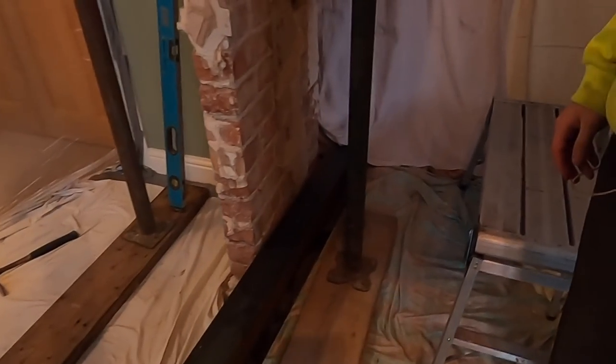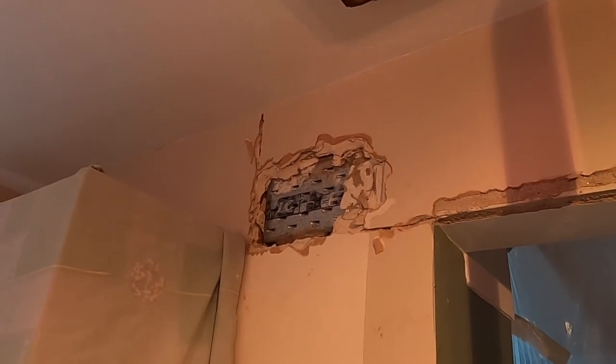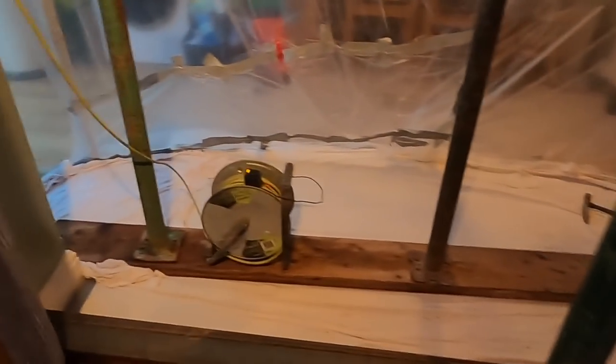Now what happened yesterday is I was rained off yesterday, so I came to re-measure just to double check my measurements. There's nobody in, so I added 70mm onto the steel, so it's a bit long, so we're just going to let it sail past the pad stone on that side. Obviously we can't do it that side because it'll go into the gap. Instead of dragging it out and cutting it, we'll just leave this bit of extra steel in. So let's go and get a brew, and then we can get making a mess after brew.